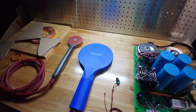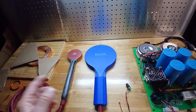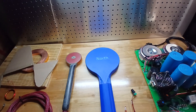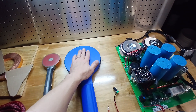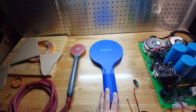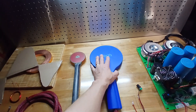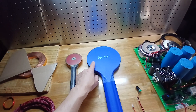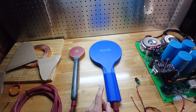This was just the introduction to this new coil. I am just starting to test it and will be testing it on different models — on 0.7 Tesla, the 3B, 2B model, 4-5, and all models will be tested with this coil. So far I like it because I can get close to 25 minutes session time without cooling the coil, and cooling is not easy — it's much easier to build a coil without cooling. This housing for the coil is available for free if you have a 3D printer; you can print it from high temperature plastic like ASA, and the files are available at my website — links are posted below this video.